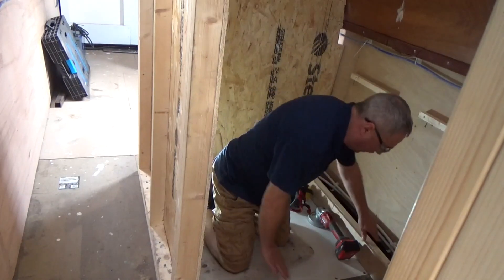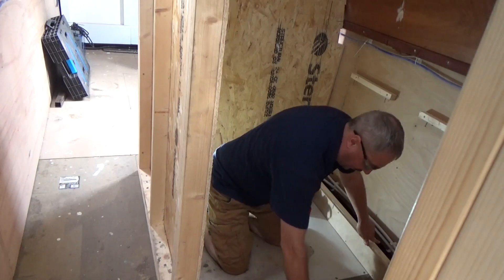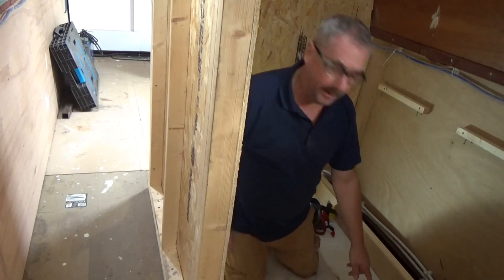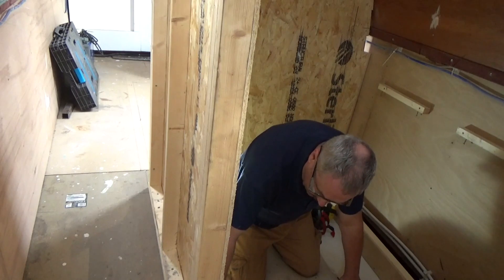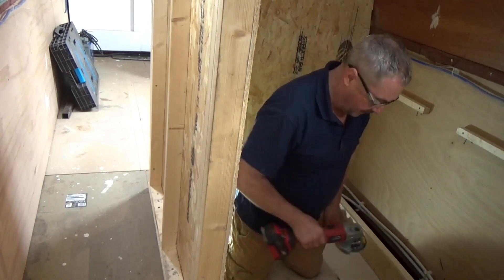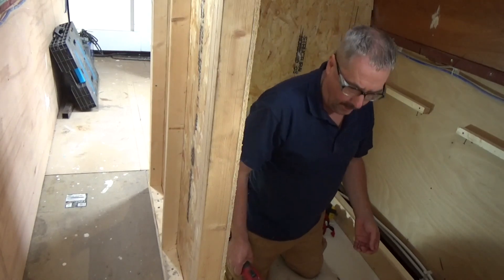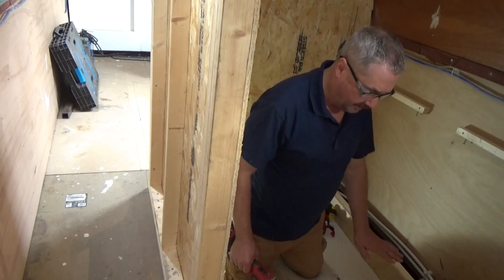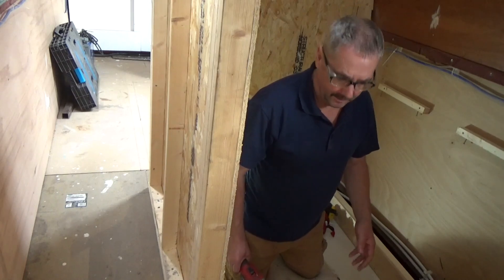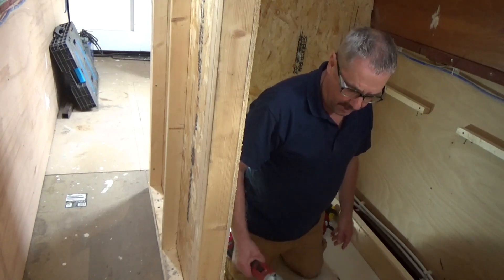Right, so we're going to start on this floor here. There's a bit of a ridge at this end so we're going to blend that back - take most off by hand and then get the sander and blend it all in. Get the mucky job out of the way to start with. This floor has just got a slight ridge up to the board, so we'll grind it back. I'll use the angle grinder to start with because that'll remove more material. Then we'll sand it and use an epoxy filler to get a nice smooth transition - no joints, no ridges - because that's where your flooring will wear.